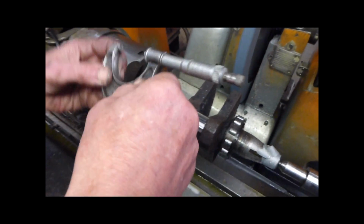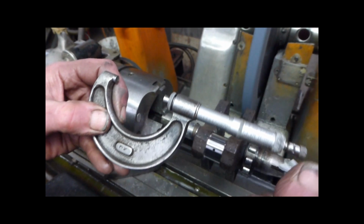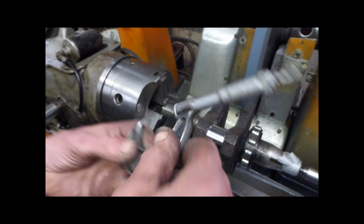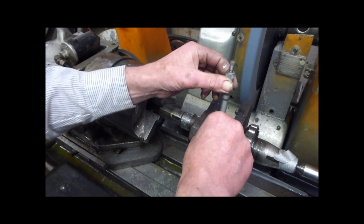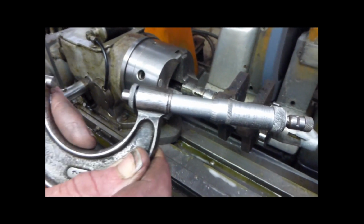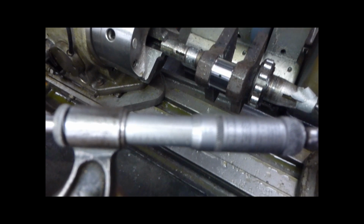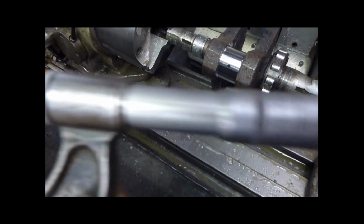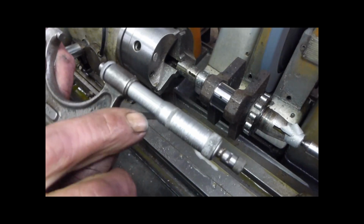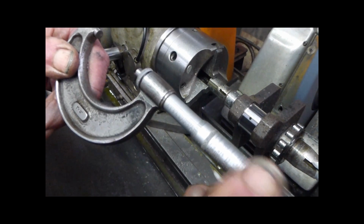There you are. It's about 1/4 thou big, possibly. See, just the thickness of the line big. Only that much, see it? Oh, right, okay. See? Yeah, it's that much. It should be in line with 15, but it's that fraction, the thickness of the line on the mic, big. Well, I'm not going to try and grind that amount off. So it's still slightly oversized. Yeah, just that thickness of the mic. See, that 15 should be on there. Yep. Well, on that little bit.